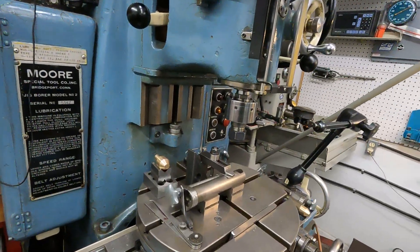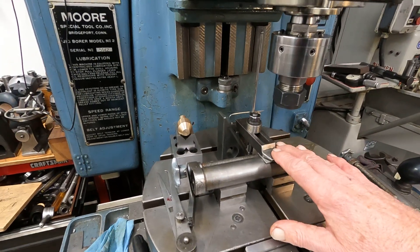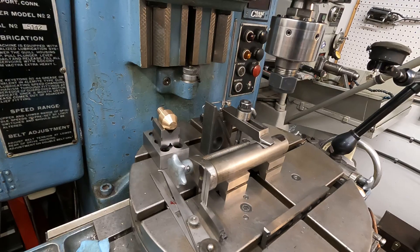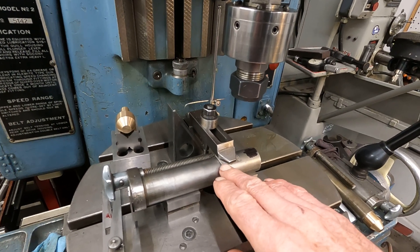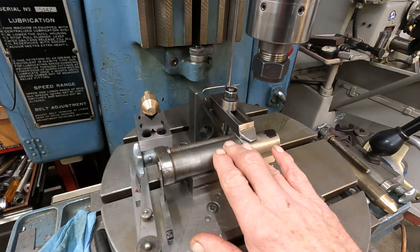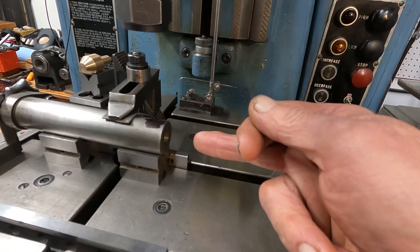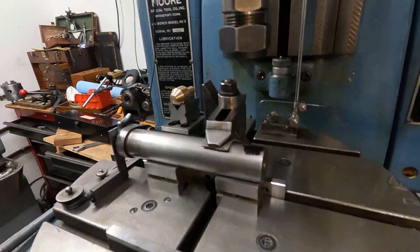The best approach is to clamp things down — similar to what I've got going here with these fingers. Use clamps whether it's a plate for holes or whatever, and carefully tighten them. I'm just drilling a hole in this piece so it only needs one clamp, with a little square piece of lead underneath — makes a nice clamping situation with very little distortion, compared to grabbing it in a vise. If it needed to be more accurate, I'd have mounted it on V-blocks.